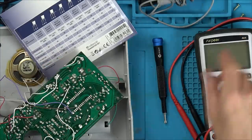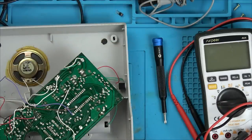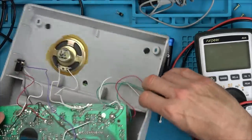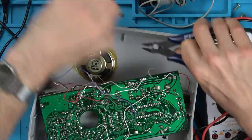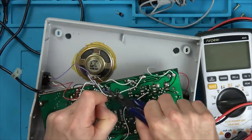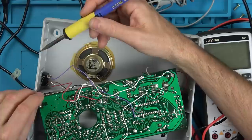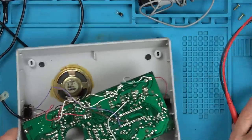I must have shorted across — I've still got the batteries in. Oh look, this has come off from somewhere; I need to solder that back on. Let's pop the batteries out — I heard the speaker come to life! I didn't take note of where the black wire goes, but there's an empty prong up here so I presume it goes on top. Just chop down the legs and trim back a bit of this cable. It looks like the transistor just failed because nothing really seems to have caused it — everything else looks lovely.